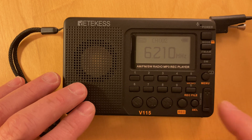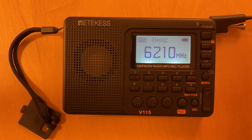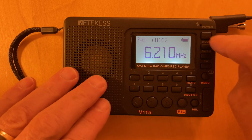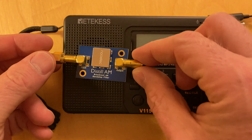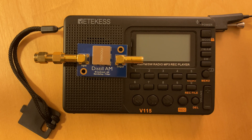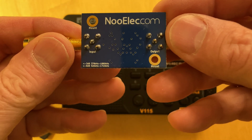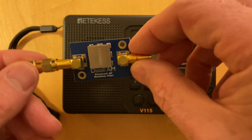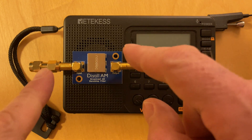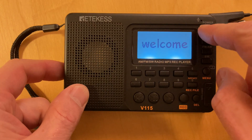I'm thinking that what we're hearing when I plug this in — I'll show it to you again — you can hear a voice in the background. I think we're getting AM breakthrough. So what I'm going to do is put an inline AM filter in and come back and see if that makes any difference. This is the AM band-stop filter I'm using. This is supposed to be negative 3 dB and then in the center of the band minus 8 dB. So that should make a bit of a difference. I'm going to remove the RTL-SDR but keep it plugged in so I'm not changing the antenna configuration any more than necessary. We've now got the band-stop filter in.